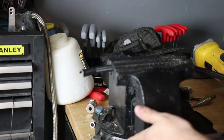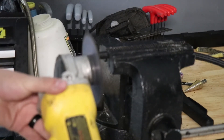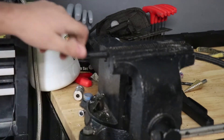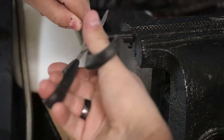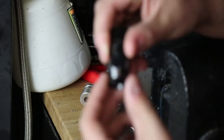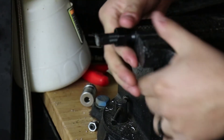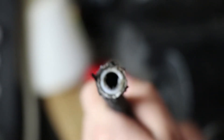Press the hose down in the vise but don't squeeze too hard, then cut the very end with the angle grinder. You can trim any extra stray strings with a pair of scissors. While you still have the electrical tape on, slide the bottom portion of the fitting over the hose. Twist it on — it'll be a little tight because of the tape, but once it's on it's nice and secure. Once cut with the angle grinder, you'll have a nice perfect circle.